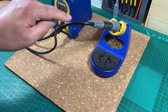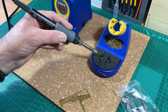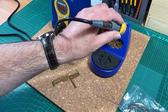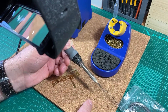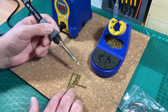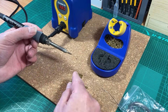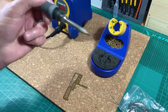So this is just how we cleaned it up. Before I use it, every time I give it a quick blast on the sponge, then apply the flux. With the tip clean, it should just collect solder off the wire quickly and easily — it sticks and doesn't bead up or fall off. Then we can just apply it to the workpiece. When I come to do the next joint, if there's a bit of solder left, I just give it a quick clean again.